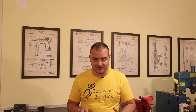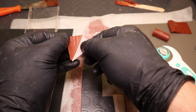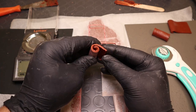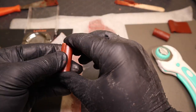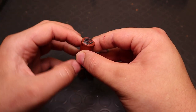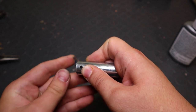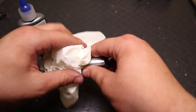What I've done is go from the tubular shape to a coiled ribbon form, which has about the same mass but twice the surface area. It is also relatively neutral burning, since the surface remains almost constant as the ribbon shrinks. The initial ribbon thickness is 3mm. I also found it convenient to prime the grain by dabbing its ends in black powder, which easily sticks to it. A trail of powder is also created in the corner to connect both ends. The grain is 40mm long and is just the right size to slide into the casing. Both the casing and nozzle are then degreased, the grain is inserted, and the nozzle plate is put back in position with the use of medium thread-locking compound that will prevent gas leakage. A steel cross pin, precisely cut to length, is then slid through and locked in place with the same thread locker.